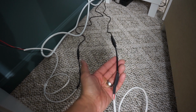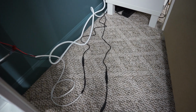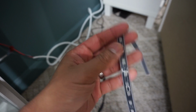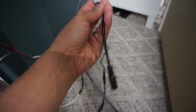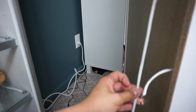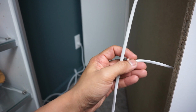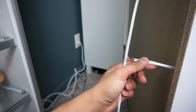And this is where the line tapped into the connector that goes to the power supply to the wall. And this connector came from the tape light. So I'll show you the one that came off of the other tape light. So right here, here's our tape light. This is what we have left over. So that portion down there is basically this cut off and connected to the white line. So I'm going to go ahead and expose the wires inside this white sheathing so we can connect these to it and give each shelf power. And I'll show you the connectors that we'll be using.